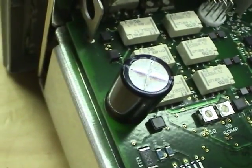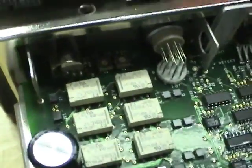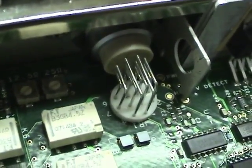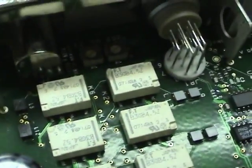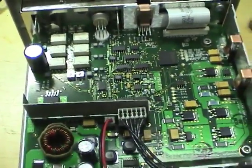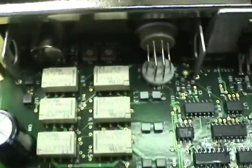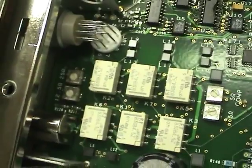This cap is the AC coupling cap, which is switched in when you put in AC coupling mode. Yeah, as far as I can tell, other than this, which is only used in AC coupling, the signal coming out of the transformer goes straight through the attenuators, optionally not attenuated at all in the 1 amp per volt range, straight into the output BNC. If you look up the manual on this, there's a decent amount of info on these adjustments and how to calibrate them. It gives you the full procedure.